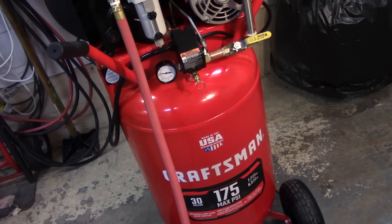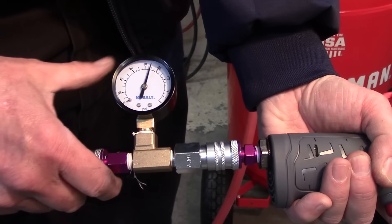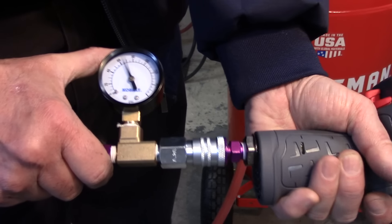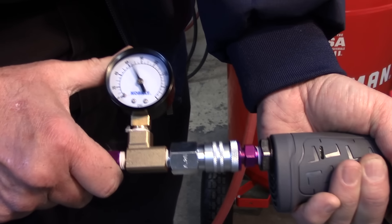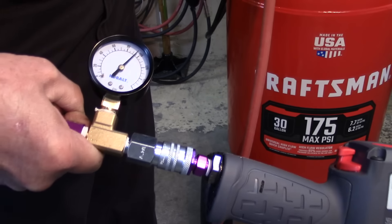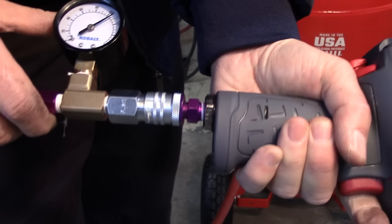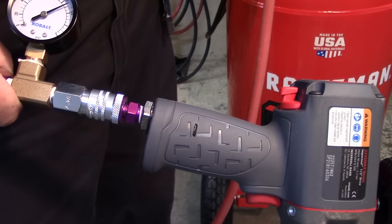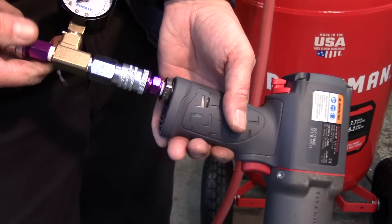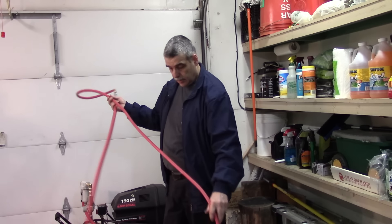They're pretty much identical as far as quarter-inch fittings go, then I step them up — and you'll see this one works a lot better. Line pressure is at 90 and when I squeeze it drops to 70, so it's breathing easier. All I do is turn the pressure to 110 and I have 90 on the gun. It works a lot better with half-inch piping. Of course on the small compressor you can't really do half-inch piping, but on the bigger unit you can. And what's nice with the quick disconnects is you can simply swap the half-inch hose for a regular three-eighths for everyday use — makes your life a lot easier.